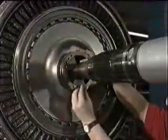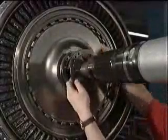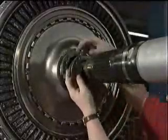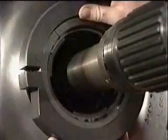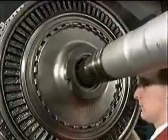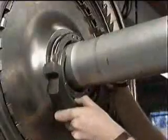During the reinstallation of the LP turbine to the engine, the support sleeves will have to be changed in the reverse order to module removal. So, remove sleeves C, fit the spacer ring, and refit the locking collar. Now, gently push the module forwards on the hoist approximately 12 to 15 inches. Remove the spacer ring and fit sleeves B.